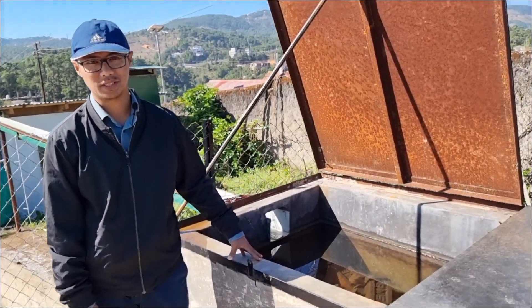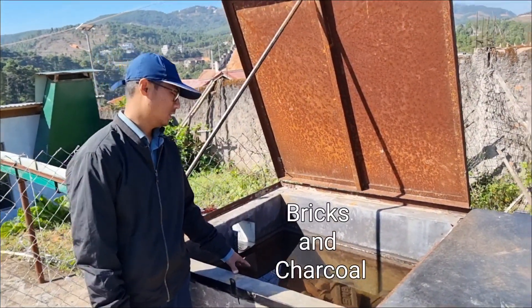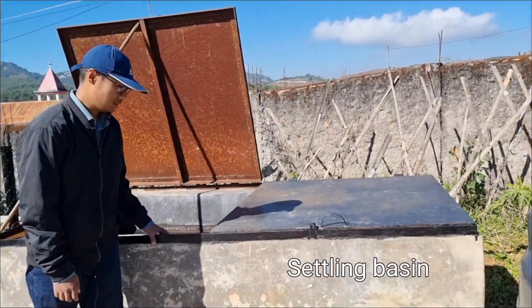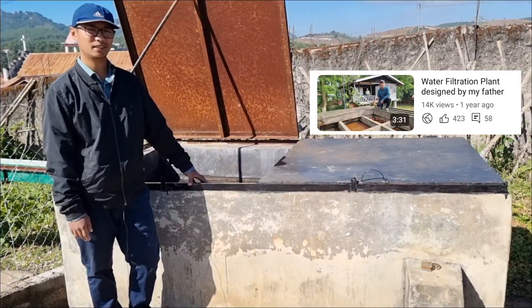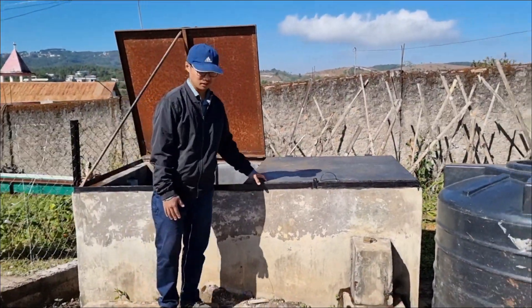This is the preliminary filtration tank and it has two chambers. The first chamber has a combination of bricks and charcoal, and the second chamber is a simple settling basin. This is a very toned-down version of the filtration system designed by my father — you can check out that video if you like. After this basic filtration, the water comes down to the storage tank.